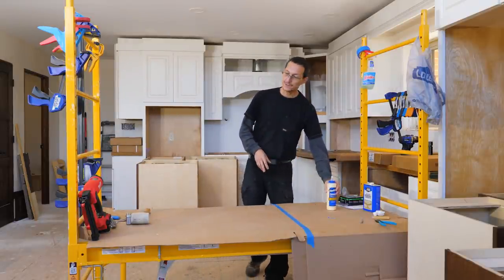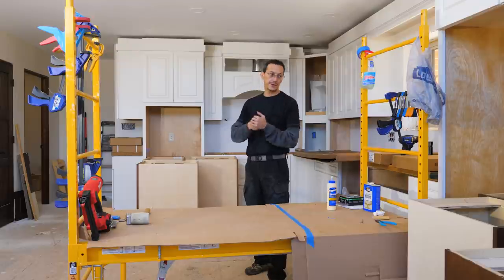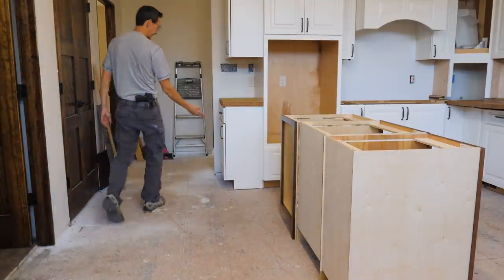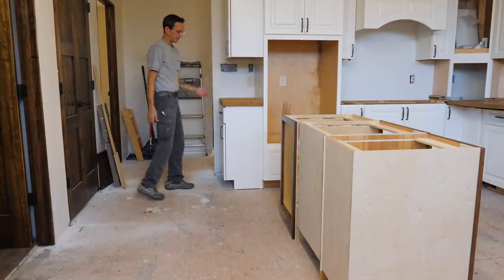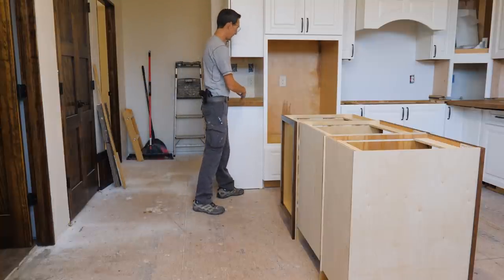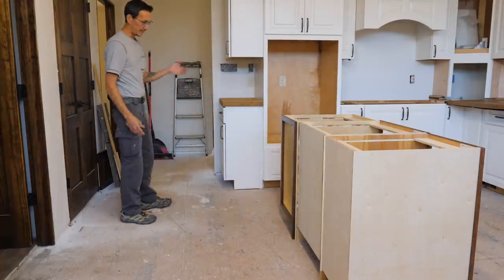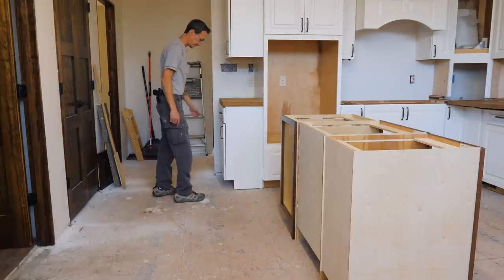Our second order of cabinets is assembled. All the cabinet boxes are put together and now I get to install everything. People commented that this side toe kick is flush and not inset like the rest. Originally I thought it wasn't a big deal because you're never actually going to have your toes there — you open the oven out into the space — but it still doesn't look right. I went back to the plans and it's actually designed to have a toe kick inset there, but there was a note on the order that it had to be modified in the field.